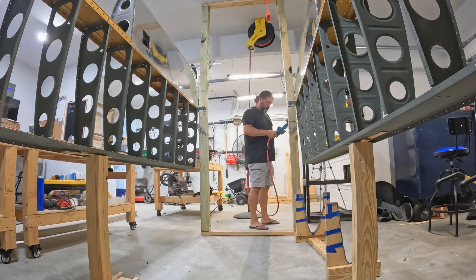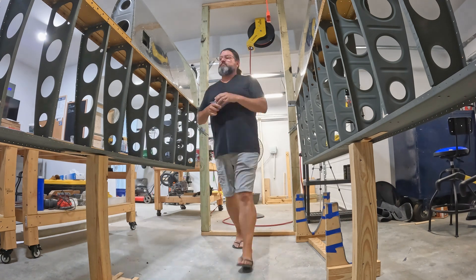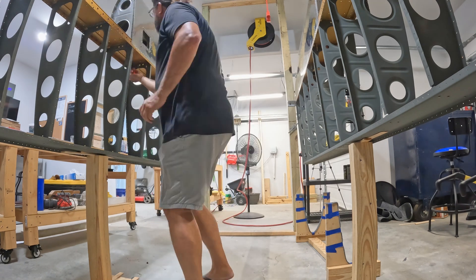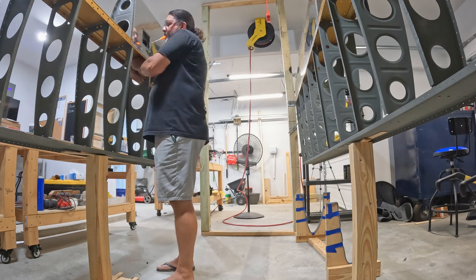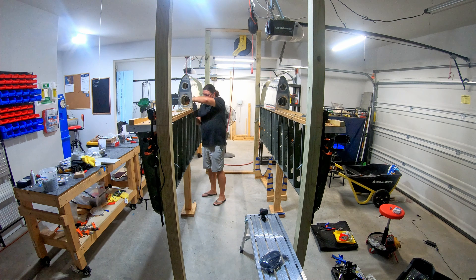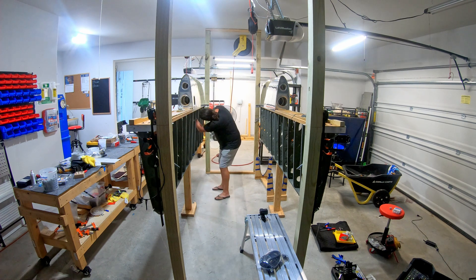Episode 100 — maybe 104 or 105 actual work sessions. Simple work today: we've got four interior ribs on each leading edge that need to be riveted — the rib flange to the main spar. I'm starting here and the first couple I go kind of slowly, trying to work out how to best get those LP4 rivets fitted in there. Stay tuned toward the end of the video for an amateur tip — a better look at those LP4 rivets and how to select the right size.